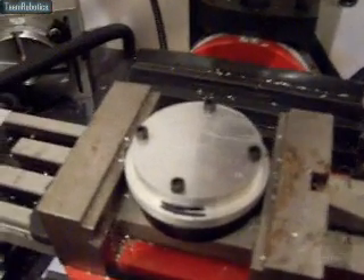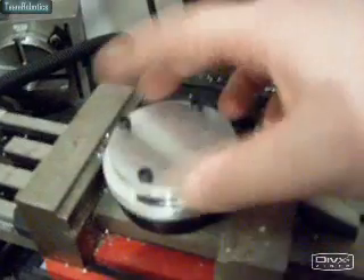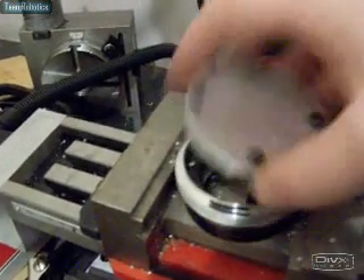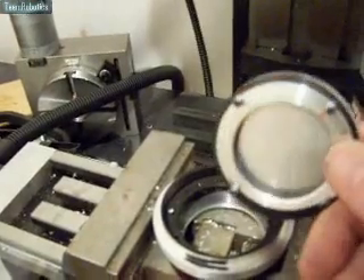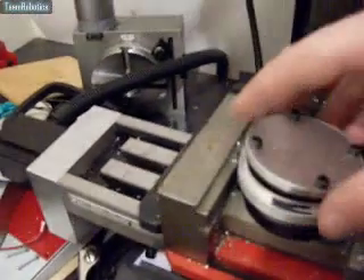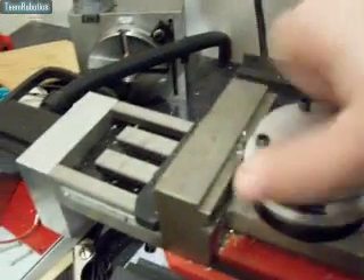As discussed earlier, here is the same piece of plate that you saw that was set out for the screws to match with the tapped holes on the rear lens unit. And this is how it is after it's been in the lathe — that square piece of metal has been machined round to fit perfectly with the other piece. That's now ready to have the hole put in the middle and the small servo mounted on the back of it, and then that will be fine for controlling the irises.